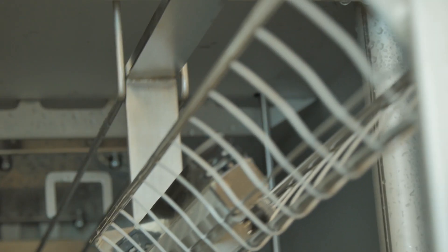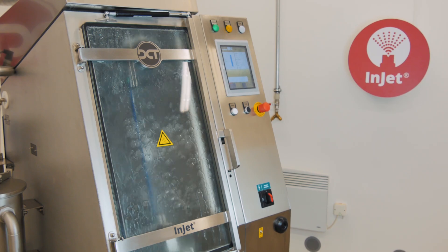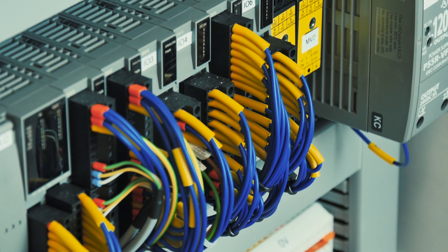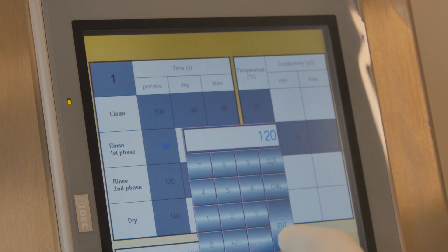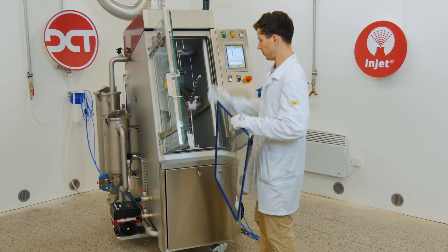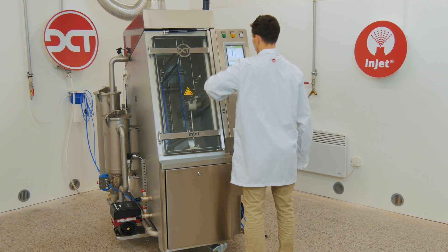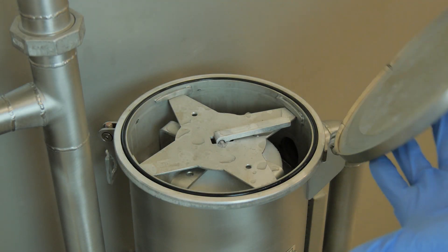The combination of spray in-air technology and vertical layout achieves the highest efficiency of the cleaning process and zero shadowing effect. The cleaning process is electronically monitored and controlled by the PLC. All the process and maintenance parameters can be quickly adjusted on the touchscreen. The whole system is designed for easy access and regular maintenance such as exchange of filters and seals that can be done quickly and without using any tools.